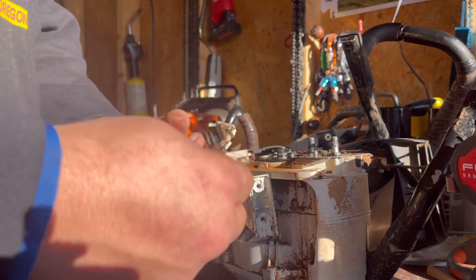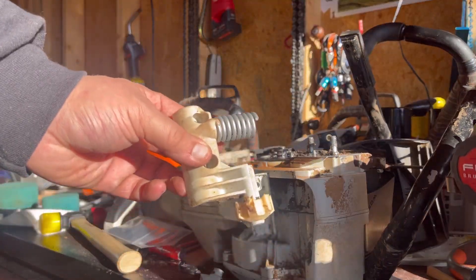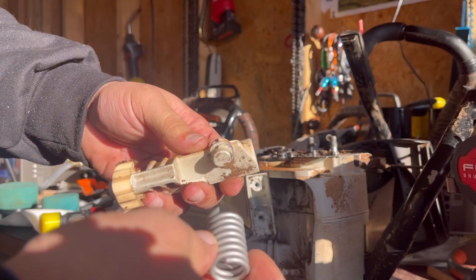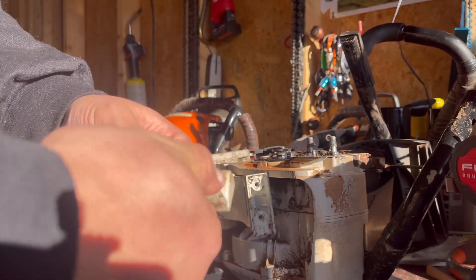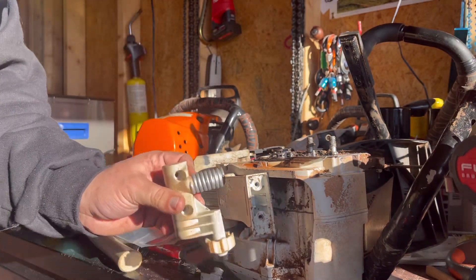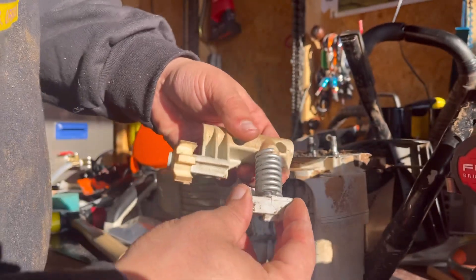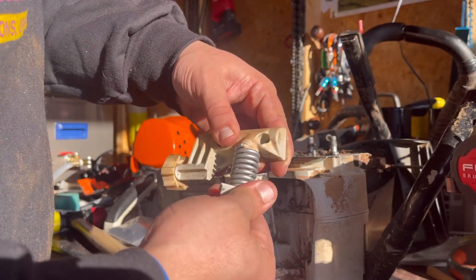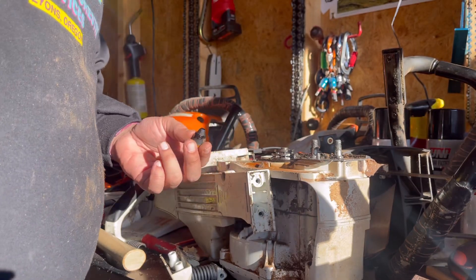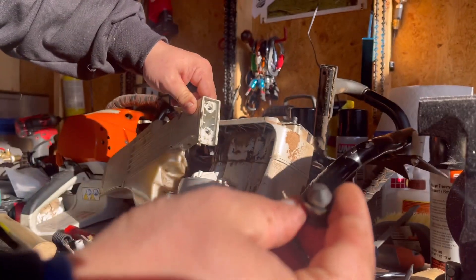This is the piece that your bar connects to. On the 500i, the West Coast Saw spring mount just screws on like so, and I'm going to stop at this point because I want to put some rubber hoses in the spring. But if you weren't doing the hoses, you would just screw this in and it stops right there. For this guy here I'll just put a little bit of spit on it — there it goes. That's what the old mount looks like, the stock mount.